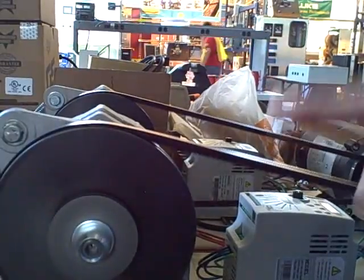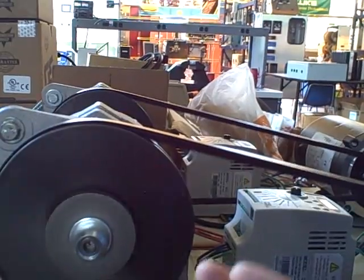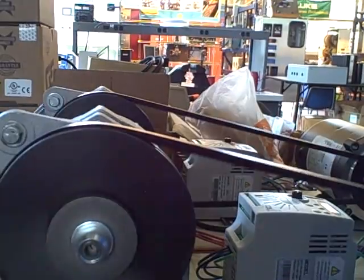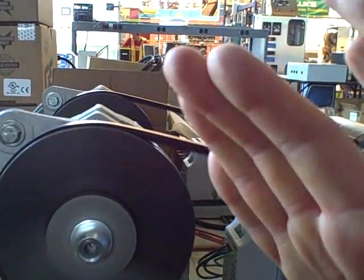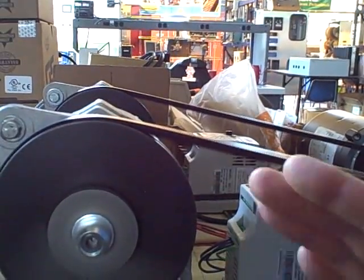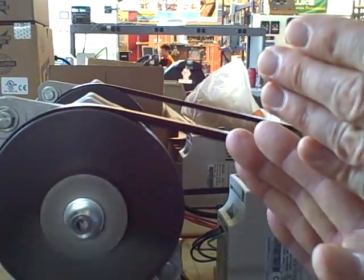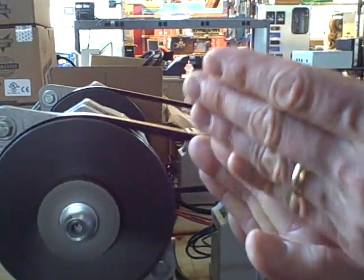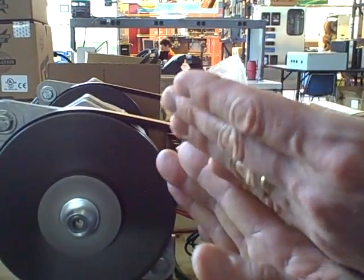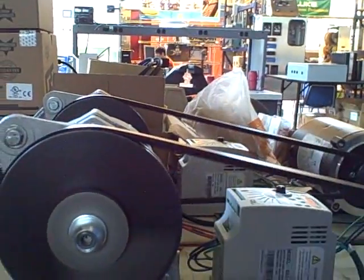This one is slightly ahead, slightly further counterclockwise. This generator is trying to push harder, but it can't go faster because it's electrically linked to the background generator, and they will keep each other in sync even though there is a slight angular displacement. This is analogous to having a flexible mechanical coupling between these two shafts — when one device tries to spin faster, it will flex and stress that coupling, allowing it to splay and angle slightly, depending on whether the foreground generator is applying torque to the system or trying to take torque away.